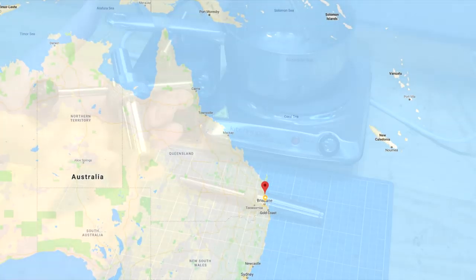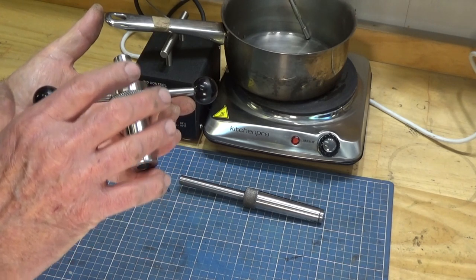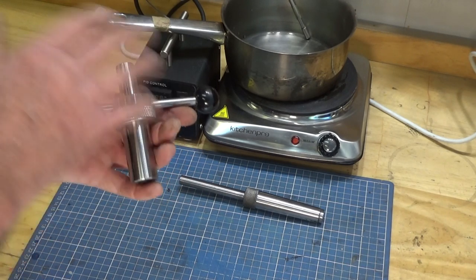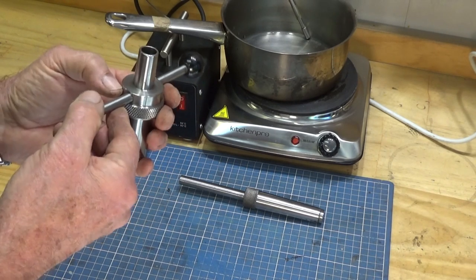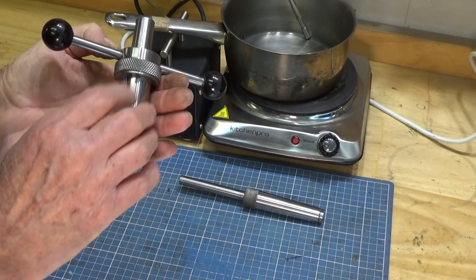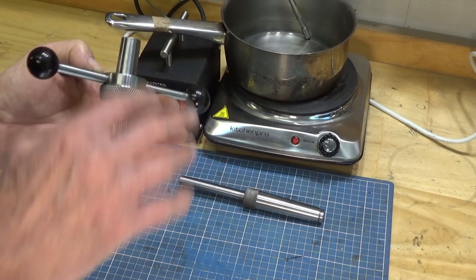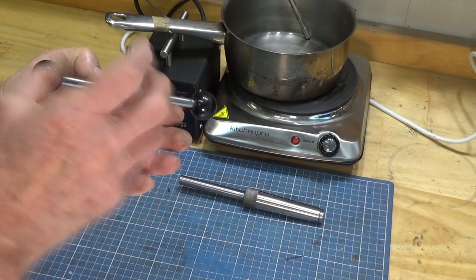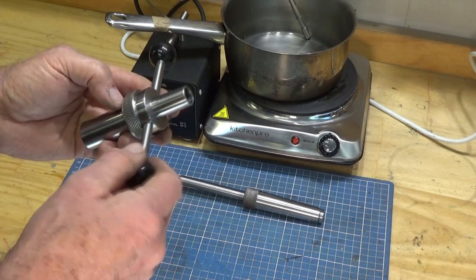We get warm, humid days. As soon as the sun goes down, the temperature drops and moisture will condense out of the air onto any surface that's relatively cold. So, bright metal surfaces like these get a film of moisture on them. If there's any dust or grit or grime on the surface, that traps the moisture even more, and pretty soon they start to look pretty horrible.